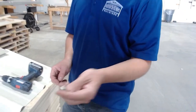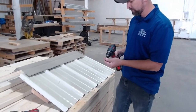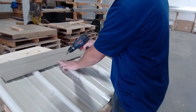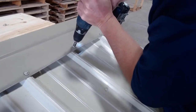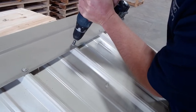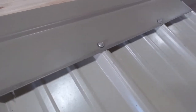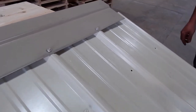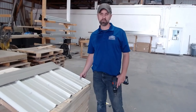So I'm going to attach this final screw to a ridge cap here, making sure I hit the high rib of the steel panel below it. Put some force down — snug, but not too snug. There, you can see the ridge cap fastened down nice and tight. It shouldn't shake or vibrate in the wind. That's a stitch screw.